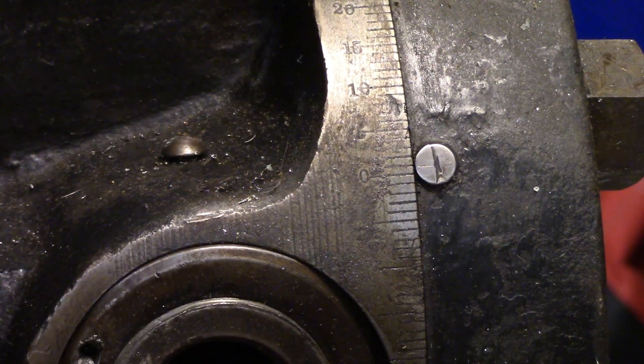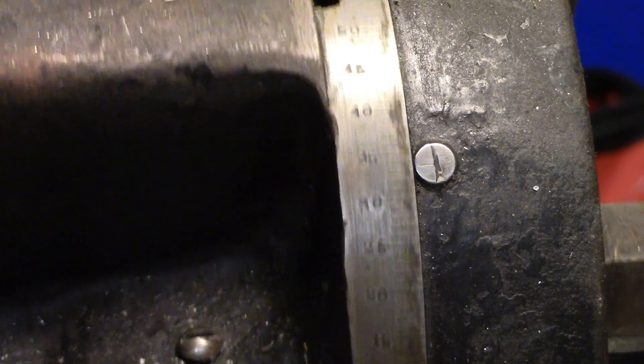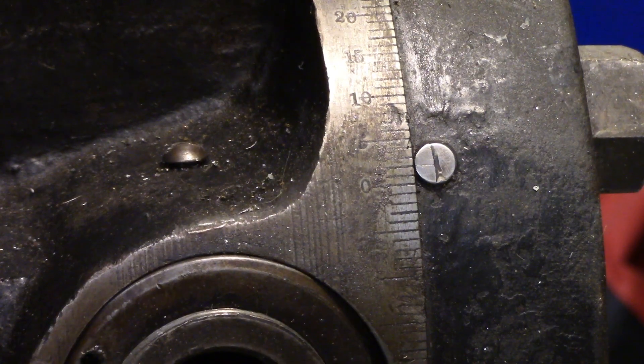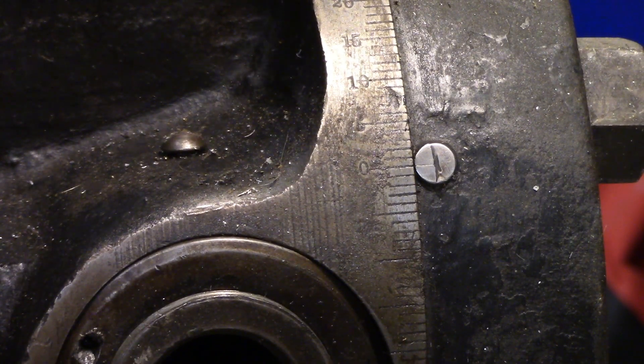Here's what I was talking about — that front nut underneath the chuck is actually being hit by the chuck right now, so I can't go any lower. I'm going to have to switch out to a half-13 bolt to keep that as low as possible, or maybe I could just take out that washer. We'll try that. Taking out that washer probably gave me the extra degree I needed, and yeah, that looks pretty good.